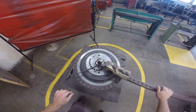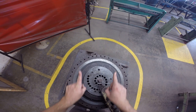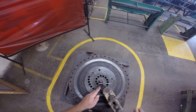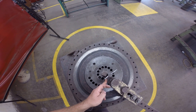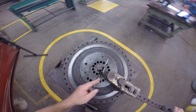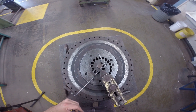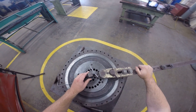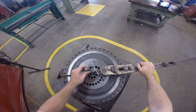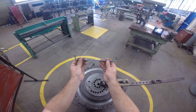We're going to tighten it in. You're going to bend it so both points — or both bends — point in the same direction. Place this in as close as possible; makes a nice, tight 90-degree bend. We'll stop right there and take it back out.